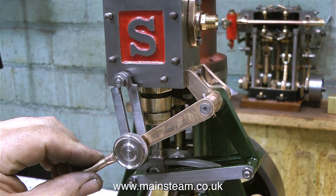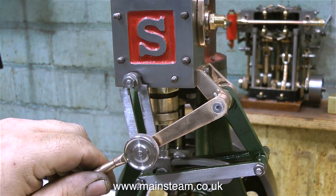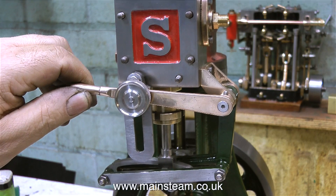In this clip I've frozen the image. This is with the lever dropped to the bottom, and the hole in the expansion link that connects to the eccentric rod is not fully in line with the valve rod. And when I lift the lever to the top, this one isn't in line either. In the workshop I still have the twin 5A steam engine that I rebuilt for a customer, and I notice on that one that the reversing lever and the drop arm are not at 90 degrees. So I think I'll duplicate that, and this problem will be eradicated forever.